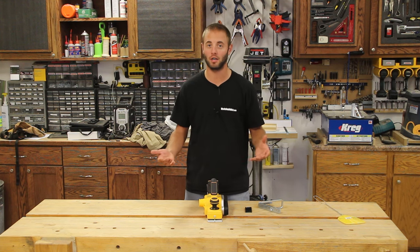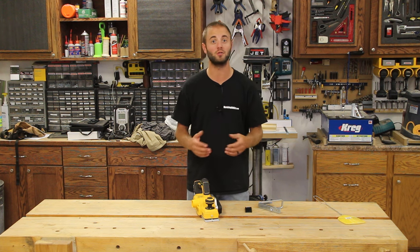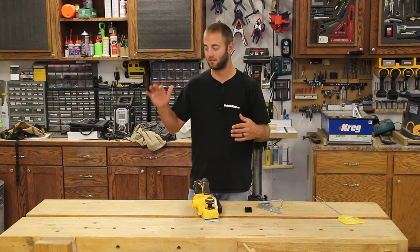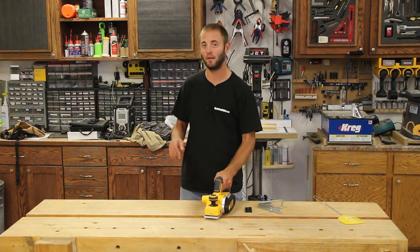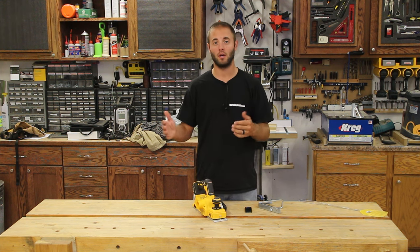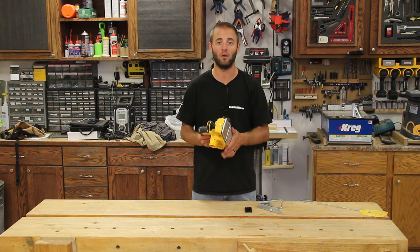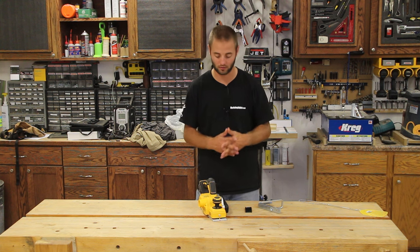What am I going to use this for in my woodworking shop? I'm not a contractor — I'm permanently in my shop. This will be great for taking large twists, cups, or bows out of boards before I go to my jointer, so I don't have to run them over the jointer twenty times. I can assess the board at my workbench, mark the high spots, grab this with a battery, hit those high spots, and get the board relatively flat before heading to the jointer. My previous planer was corded, so I was limited by cord length and outlet location. With the battery unit I can bring the tool to the workpiece anywhere without messing with extension cords.